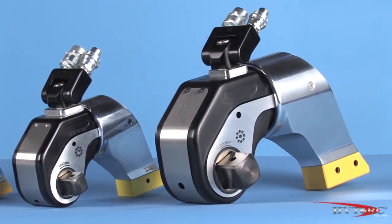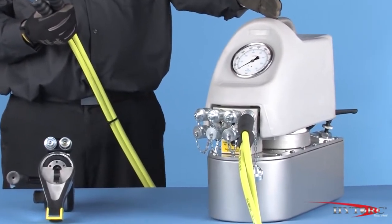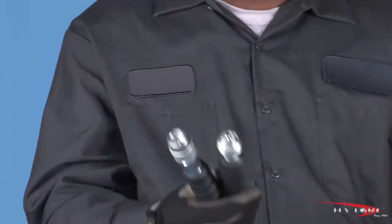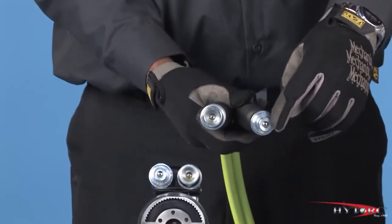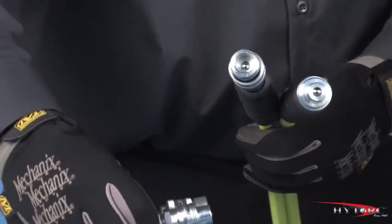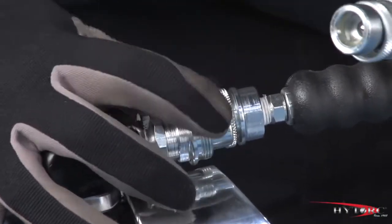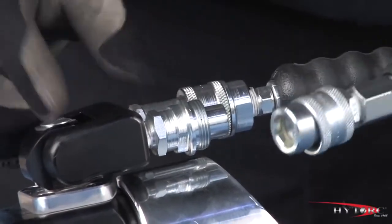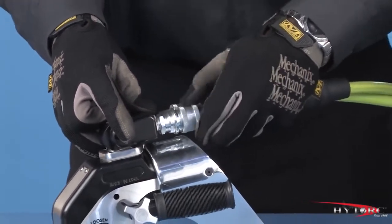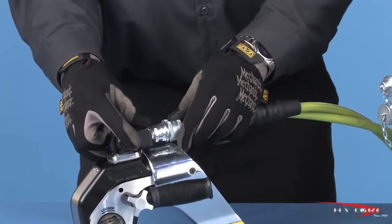The Edge is powered by hydraulic oil from a pressure-regulated pump system connected to the tool by special high-test hoses. Note that both the male and female unions feature a small, spring-loaded check ball which must be fully seated for the oil to pass. Ensure that the hoses are firmly screwed to the Uniswivel using only finger-tight force. Even the slightest loosening of the threaded connector will shut off the flow of oil, preventing a high-pressure leak. Do not defeat this important safety feature by substituting other connectors that may not be rated for 10,000 PSI pressures.